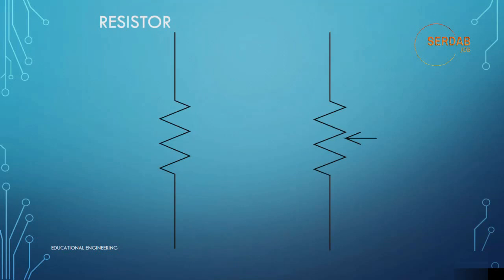the simple circuit components. This symbol on the left is for a fixed value of resistance. The symbol on the right shows a potentiometer, or a pointer that can be moved across the resistance to vary the resistance. We must point out that using variable resistance is very common in volume controls on audio equipment, dimmer lights for rooms, and a lot of other examples. Generally, a symbol with a pointed arrow associated with it represents a variable or changeable component. Not just the resistor, any other component with an arrow or a pointer will represent a changeable value.